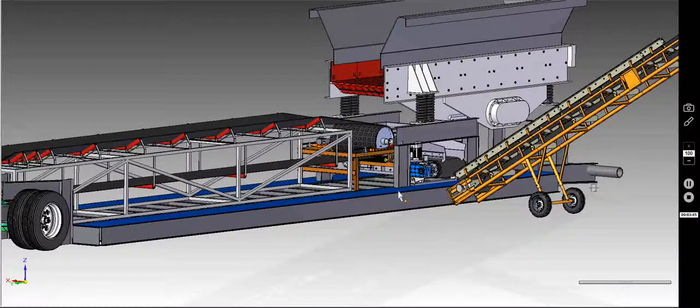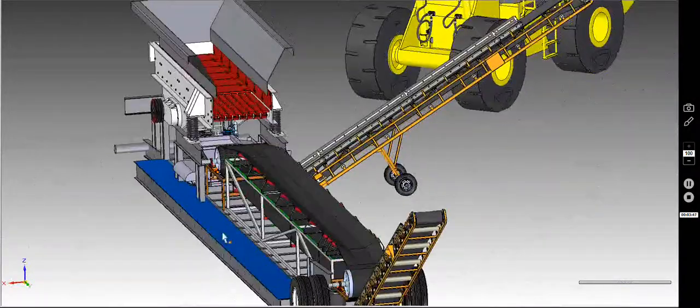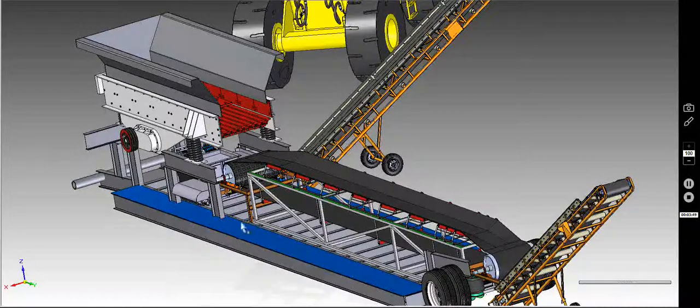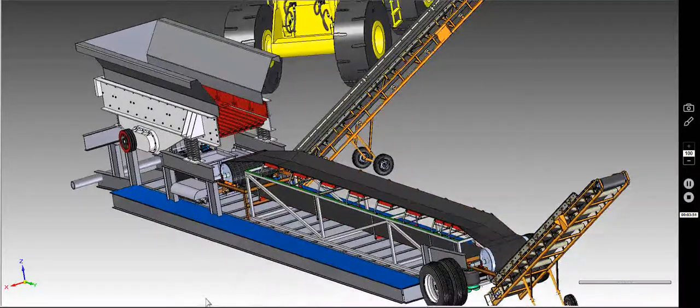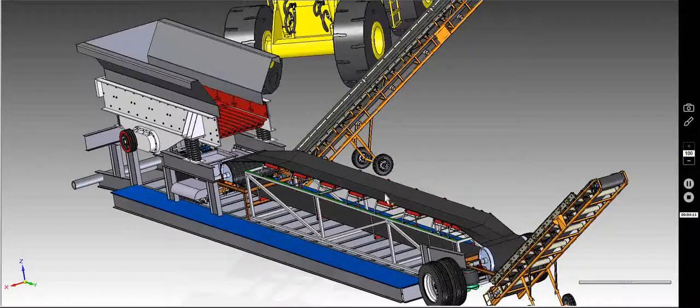Platform down either side. We talked about 30 inches wide so that either of the guys can walk up and down. Another feature of putting the container right on the ground is having the ability to have your sorting bins also on the ground, so no need to rack them or house them up higher, or no need to drop stone down into them. You're all at the same sort of working height. Again, as the material flows down the main conveyor out onto your stacking conveyor.